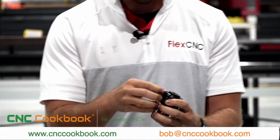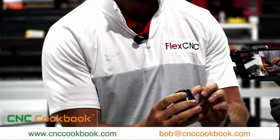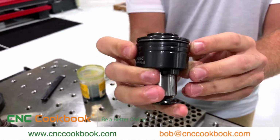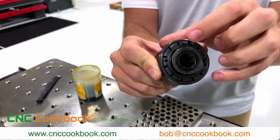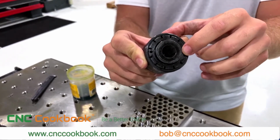And then on the tap holder, there's actually a retaining ring that goes around the tap here. Can you see that? So there's a retaining ring on there that locks the setting in. So you snap off this retaining ring, and then you can see on the face of the tap holder, there's all of these different slots. These slots are different settings to where you can either tighten or loosen that setting depending on the material